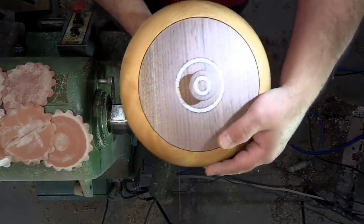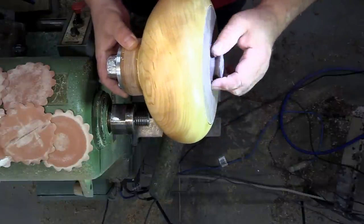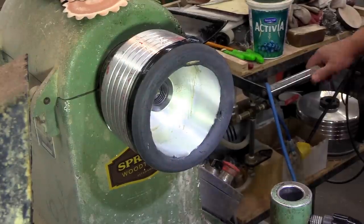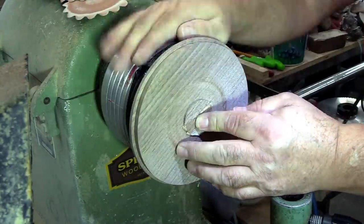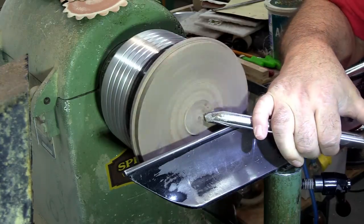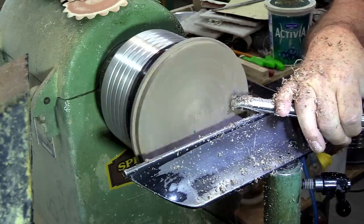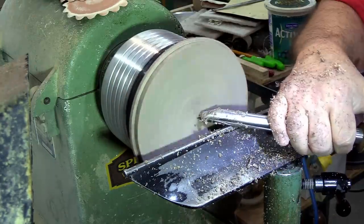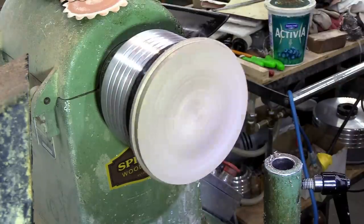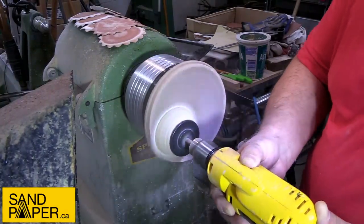There's what it looks like down inside of the bowl — really happy with that fit. I love the look of this piece. On to the vacuum chuck. It's important to clean off the neoprene seal before you use it — if there's finish on the piece going on it, it can actually mark up your work. Make sure there are no foreign bodies in that neoprene seal before mounting. Not really a big deal here since there was no finish on it, but worth pointing out. Just like the top, the bottom side was sanded to 320 as well.